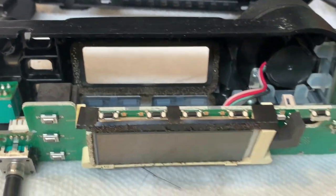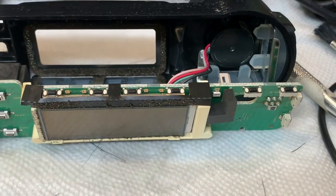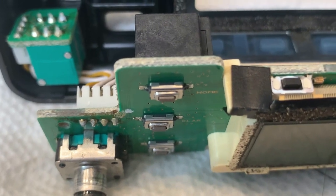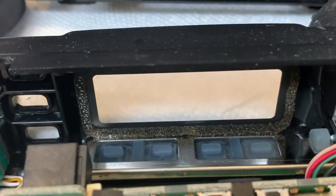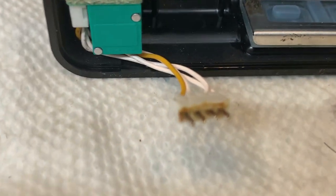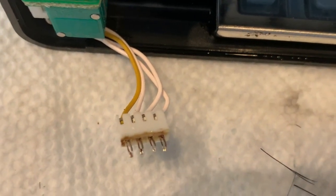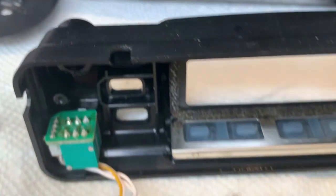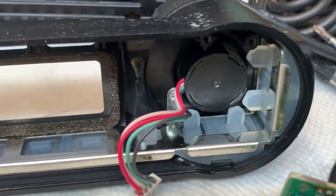Here's the old panel pulled out of the control head. We've got the buttons out of it, and the shell casing is there. The next thing we have to do is unsolder the volume control from the panel board so the two assemblies are free of each other. I've got the panel pulled away from the housing, the volume control has been unsoldered, and I've wicked all the little pins clean so it'll slide right into the newly rebuilt panel.